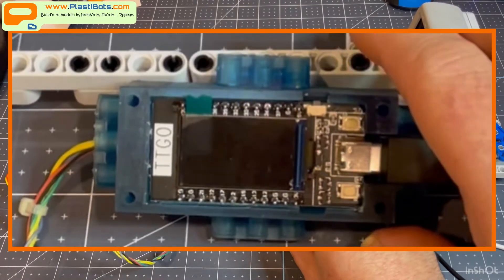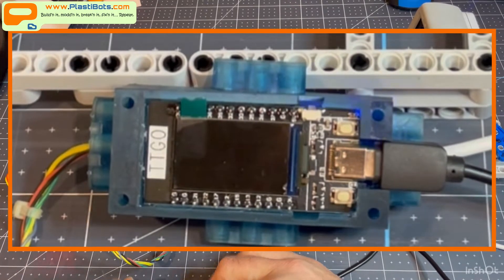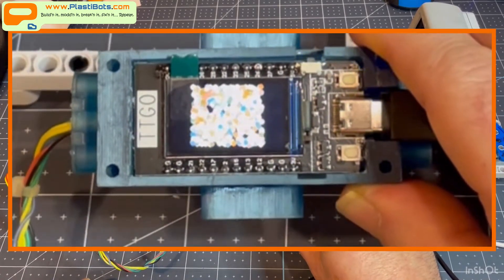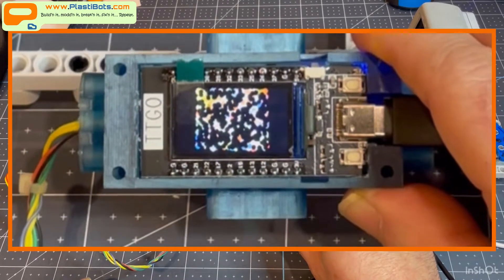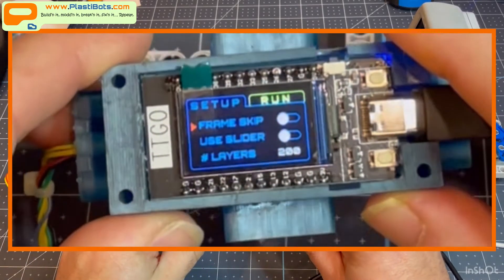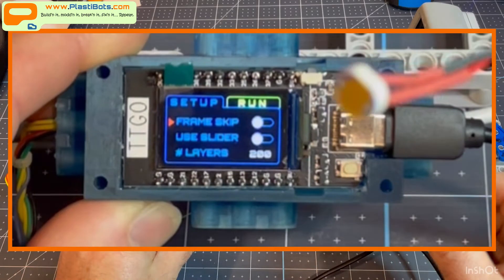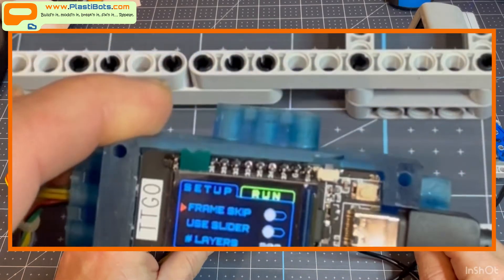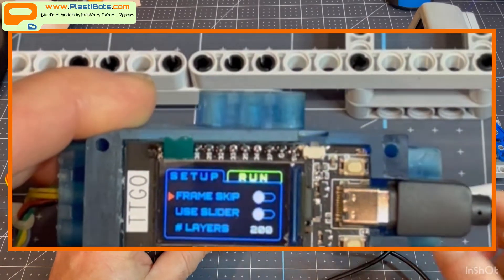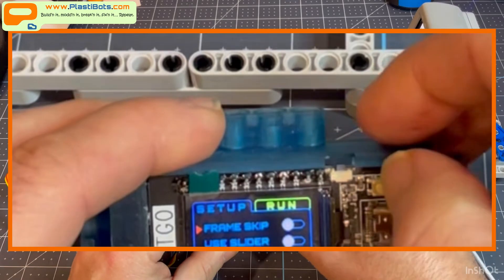Pardon the setup - it's a bit of a hack job right now and obviously not hooked up to the printer, but I use an external battery supply. When it starts up it throws a Plastibots logo with some simple animation, then flips into the HMI for setting things up. I've temporarily hooked this up to an LDR sensor just to mimic the UV light coming on and off with each layer change on the resin printer, and that's what triggers a layer change and the taking of a photo.